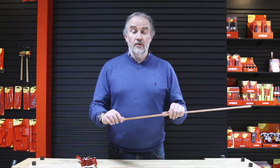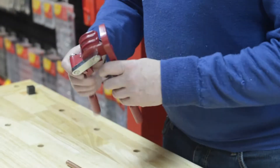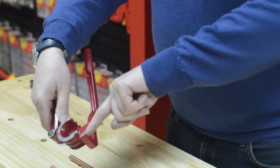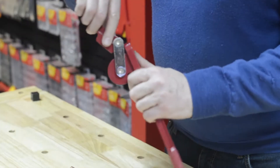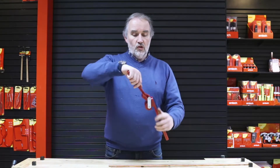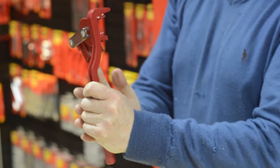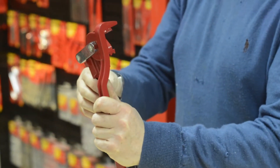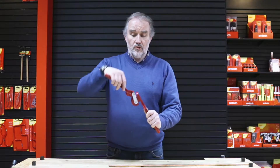The tool is fairly simple. You place the copper underneath this support arm, feed it round into one of the channels, and then as you close the handle you can pull it round in an arc. So you can see here - if the pipe was in here horizontal, I can bend it round just over 90 degrees.